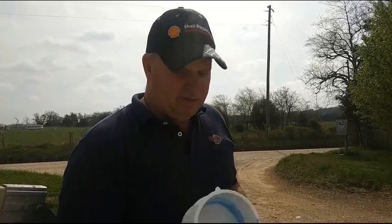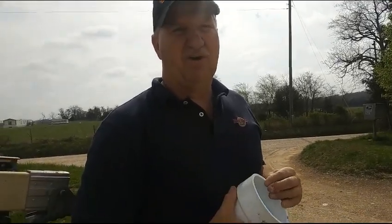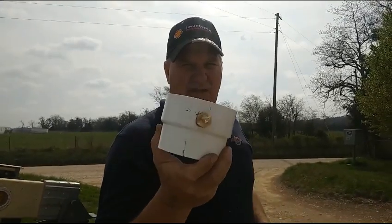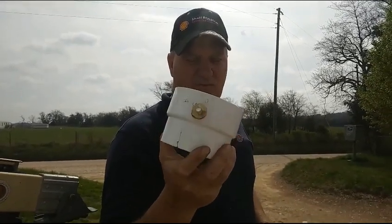This is $13 plus the cost of the hose, which has got to be clear. Then you put colored water in that — food coloring is all you need in a gallon of water. A little bit of food coloring changes it to red, green, or maybe orange, but usually red, green, or blue — a darker color. If you use yellow, you might not see it. That is how you do a water level that's really rugged.